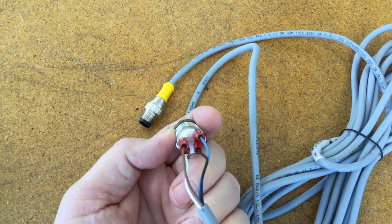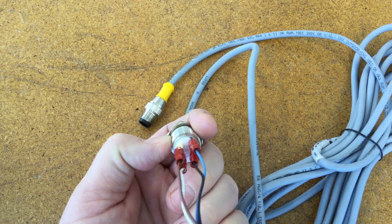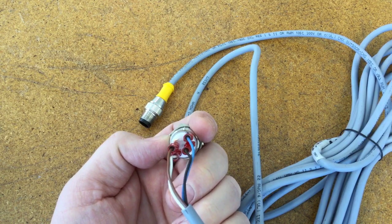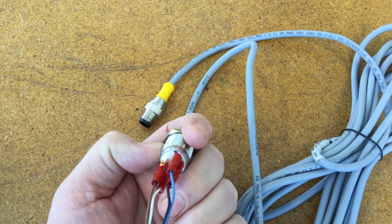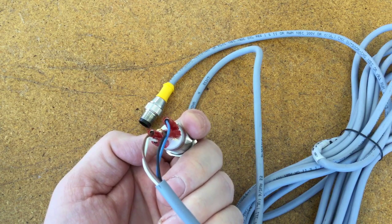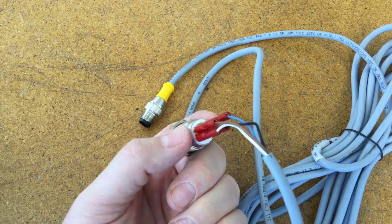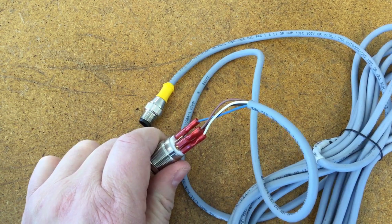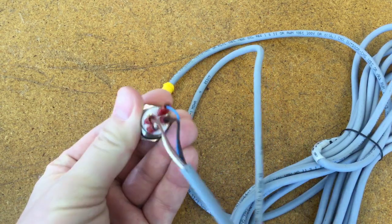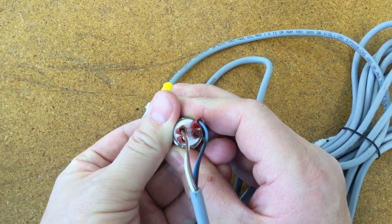As promised, here is our view of the wires attached to the back of the push button. You can see that pins one and two don't have anything attached to them. You have blue on three, and black goes next to it. Then you skip one, and you have white across on the other side, with brown next to it, and then another unused terminal. That's how the wires go on the back for M12.